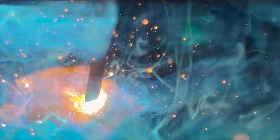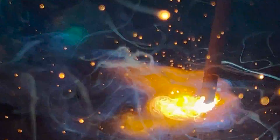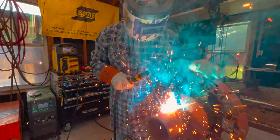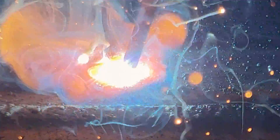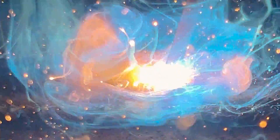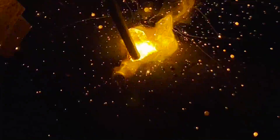There is a difference between a hot and a cold whip. A hot whip is where you're staying further in your puddle or in your keyhole. Compared to an open root versus welding on plate or a fillet weld, your arc length is going to be different — 6010 and 8010 like a longer arc length if you're not trying to put in an open root. A lot of that control has to do with your arc length and that whip coming in and out. You can make things wider by pulling a little farther away and it sprays your weld on there, or you can bury it in and dig through some metal and put roots in. It's a fast freeze rod — that's why the whip and pause technique is there.